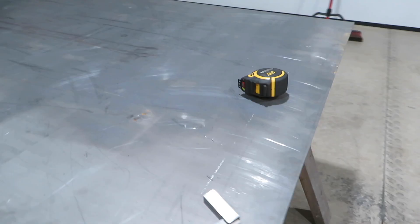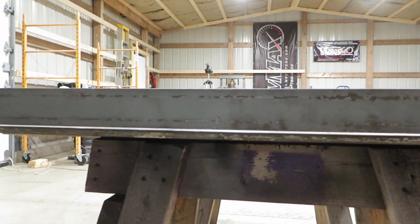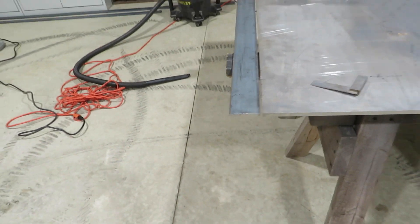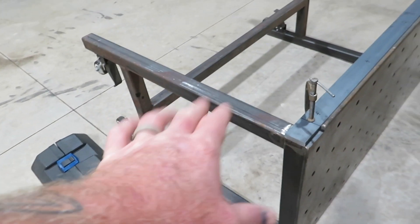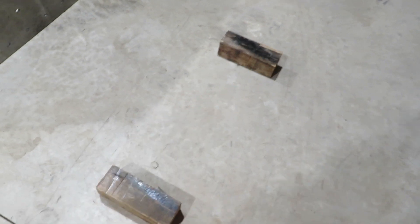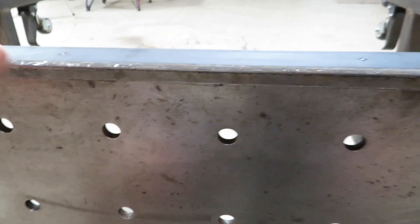Now with that cut done, I did have one of these pieces cut already. As you can see, we've got just a little bit of a gap, so we need to close that up. You can see the gap that I'm going to weld shut on this piece of two and a half — weld that solid on the other side, then just grind it flat and it'll become part of the remnant. I just flopped it over on its side using a couple of wood blocks, moved it over and set it down. I've got this other end clamped on the side and I'm going to drill about five holes — probably starting in the center or on the outsides.